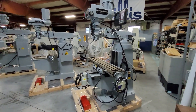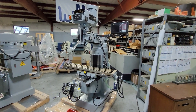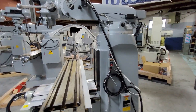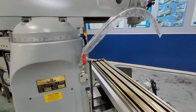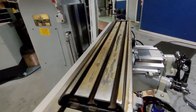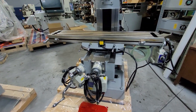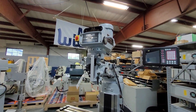We're going to start with the smallest machine here. This is our WM3VS, and we offer the machine as a straight manual machine or we can fit it with numerous different options. For example, this machine has a three-axis Newall digital readout, the optional flood coolant system, a 9 by 49 table, dovetail ways, and without any power feeds you can get up to 36 by almost 13 inches of travel. We have a three horsepower milling head with an R8 spindle.